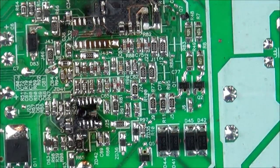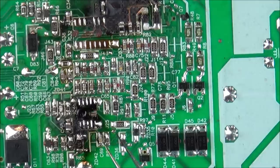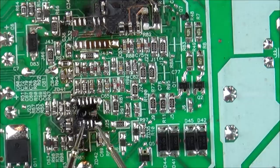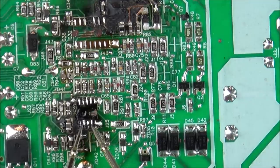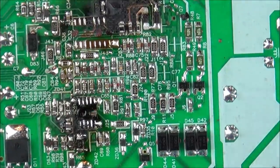That was a horrendous one — the board popped up again. This power supply is really prone to delaminating. In hindsight I should have added leaded solder to the contacts first to reduce the temperature and make the chips easier to remove. I've never had a board like this where it laminates and pops up. Anyway — now let's see if these pads are still shorting. No, they're not! And let's go between these two pins — I think we might have found the problem.